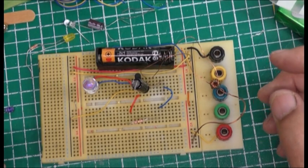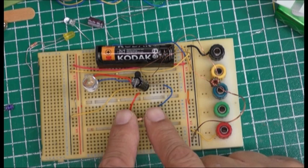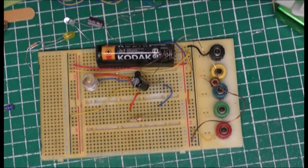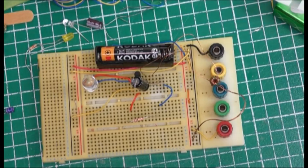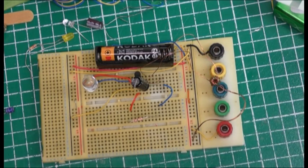So I'm very pleased with this now — I put a 100k resistor there and it's flashing slower. Let's turn the lights off and see how slow it is. This is the result I want — I want it to flash this slow. I think the battery will last longer. Yes, I'm happy with that. I'll leave it like that now and put it together as it is. I'll do a drawing of what I've done.